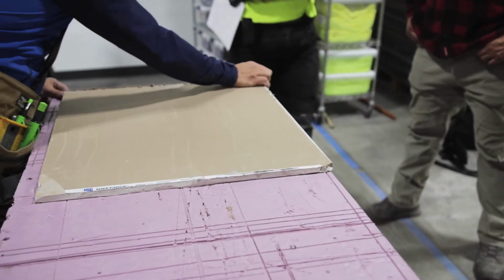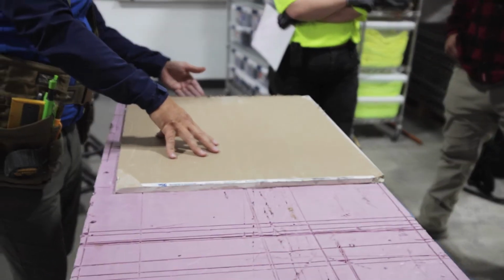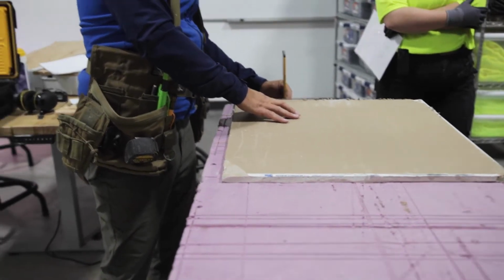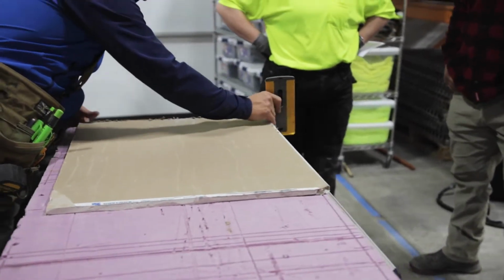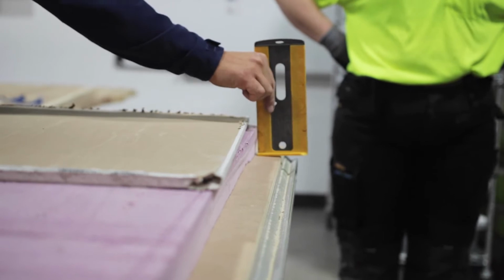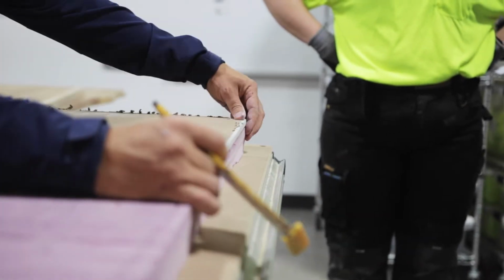What did we say about the 2x2s and the plywood for the damage? Don't let them overhang. Okay? Like this is square. Put it on your table. Hit the drywall. Hit the plywood. Do not hit foam. You know what I mean by that? Can't be like that. See that? Right. The drywall has to touch. So make sure your drywall overhangs even a good 1/4 inch, okay?